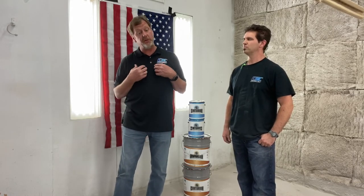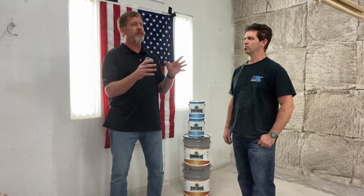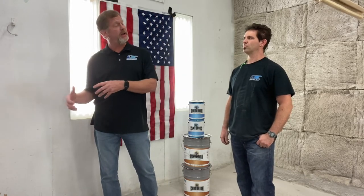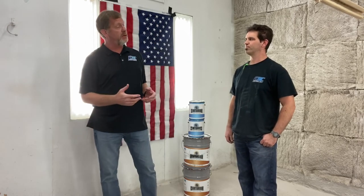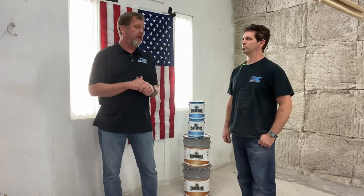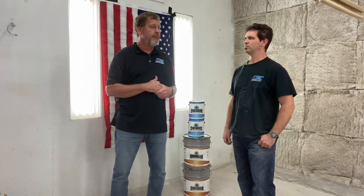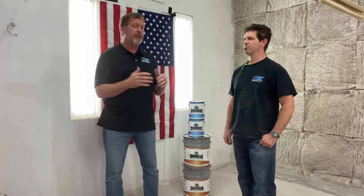My personal opinion, which is only the opinion, is I think at the cost of the polyaziridine Crosslinker, depending on what you're looking for, it's a little tougher to get the value out of the added cost. I think it's a little better to justify the added cost by putting the hardener, because you can put a larger percentage, you get a little more oomph out of it, a little more bang, and the cost of value, I think, is a little better. But it all depends on what you're doing.